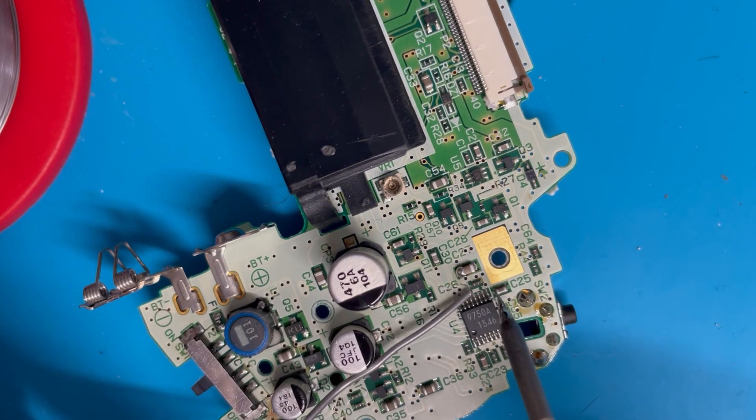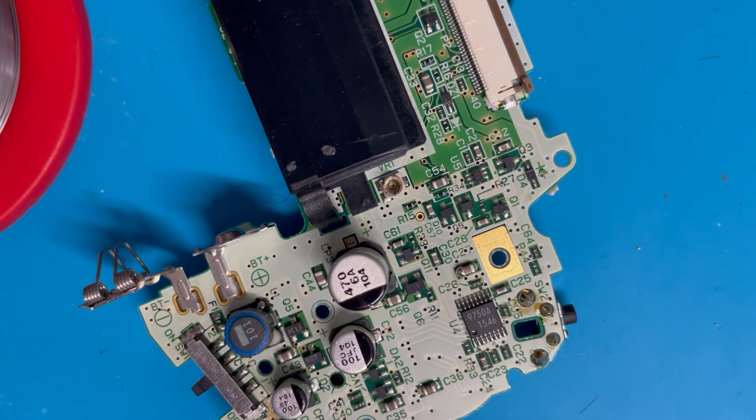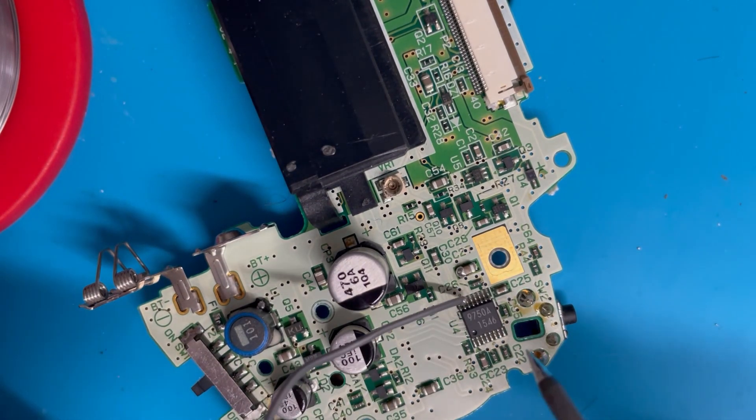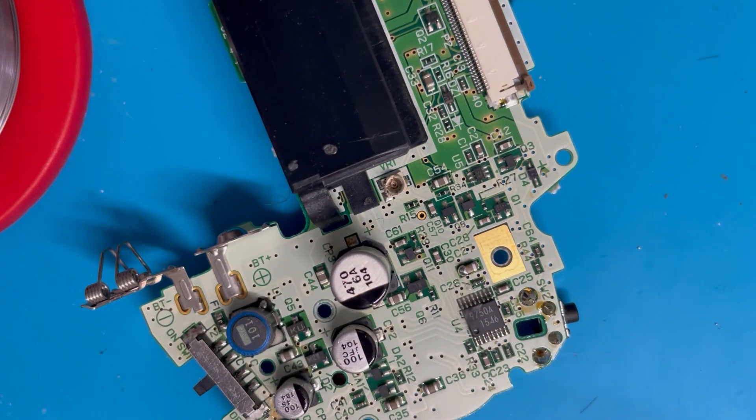The little capacitor you can leave if you want, but if you are going to tin it you have to do it quickly because the heat will transfer fast and you could pull the capacitor off. If you're going to do it, just quickly dab — if not, don't worry about it. When we put the board down it should naturally flow into position.